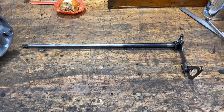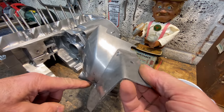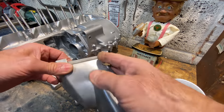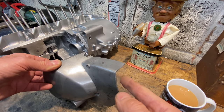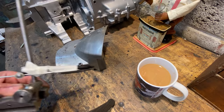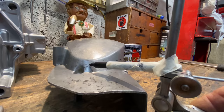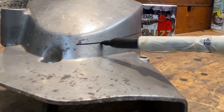So that's the gear chain shaft modified, and now it's the sprocket cover. The first thing I have to do is mark the sprocket cover with a pen so I can cut it to make it wider — then it will line up nicely with the chain guard when it's bolted onto the engine. I attach a marker pen to my scribing block with some tape, then rest it on my bench and scribe round making the mark.